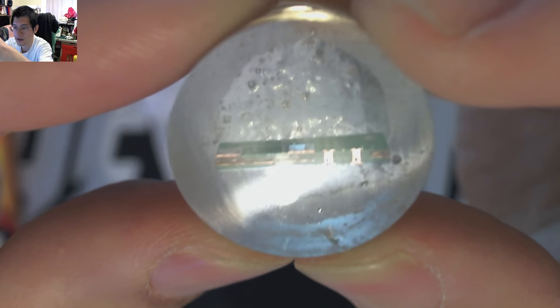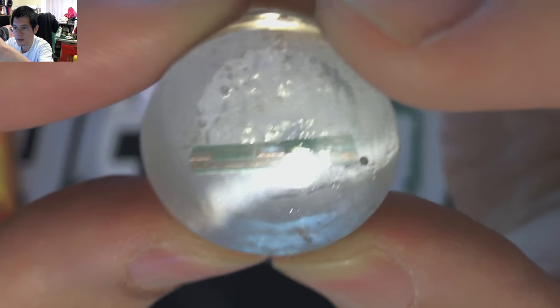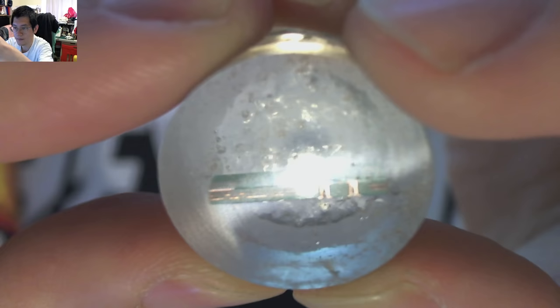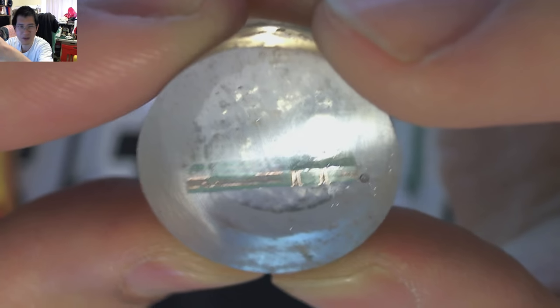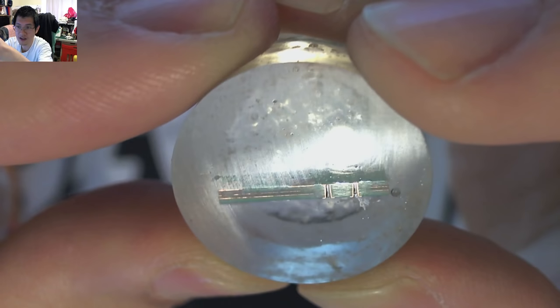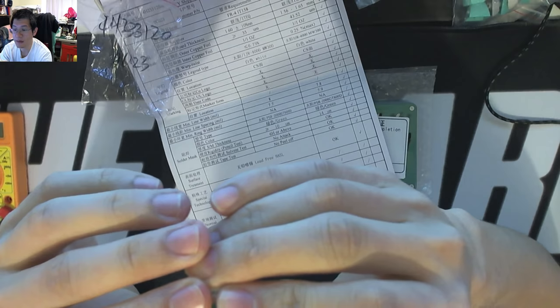And if I turn it through the light, you can see the streakiness of that polish. That means they have only taken it up to probably maybe a couple of thousand grit of polishing medium or sandpaper, like maybe 2,000 or 3,000, maybe as high as, I don't know, 5,000. When you get it to a mirror finish, that's when you're talking in the order of tens of thousands or suspensions. So it's very reminiscent of my academic days of working in a lab producing material specimens.